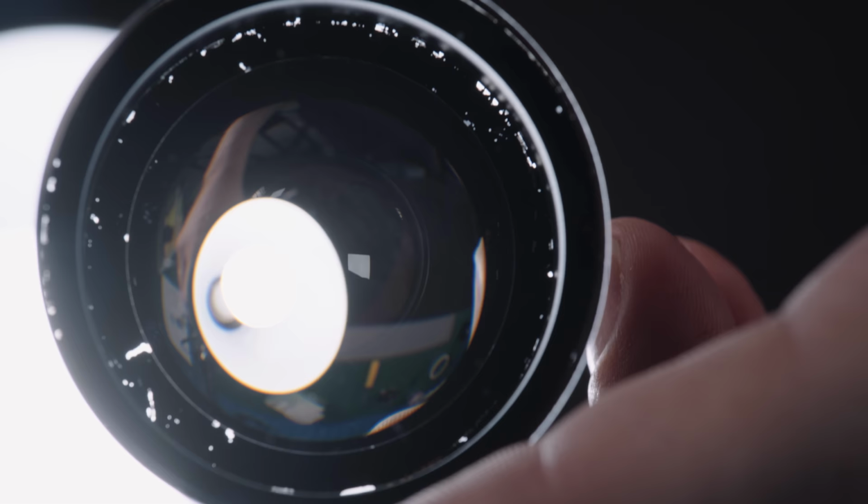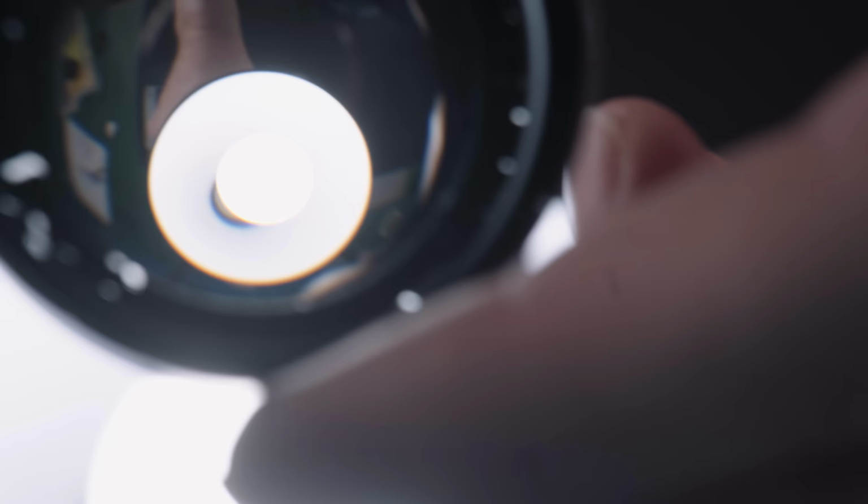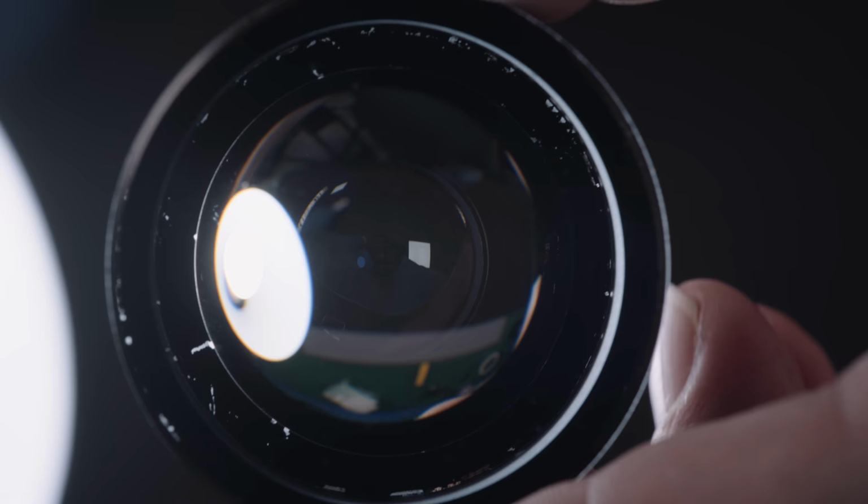The paint inside of a lens barrel can come off due to chemical processes like corrosion or mechanical damage, for example caused by tools. This example is a group that has paint defects that might cause flaring. As it is inside the group, the paint defect is likely to be chemical degradation rather than caused by tools. For rehousing, only paint defects inside a group are important, as the rest is replaced.